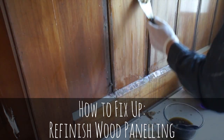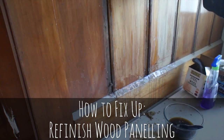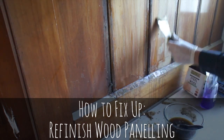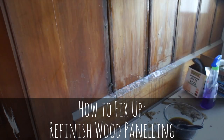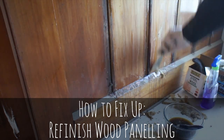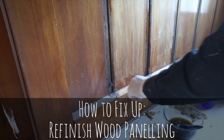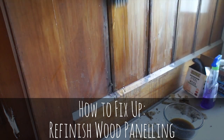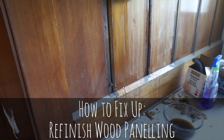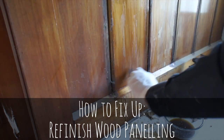With a finish like this it should come off pretty quickly. I find with this kind of finish it's best to get most of it off on the first go like this with a scraper. Almost all of it will come off straight away, and then go over again with a second coat to get every single piece off. Sometimes it's better to put one thicker coat on and leave it for 5 to 10 minutes — you'll have to try on the particular finish you've got and see what ends up being the best way.